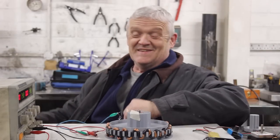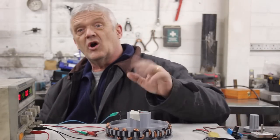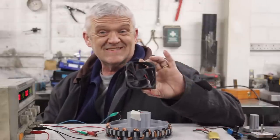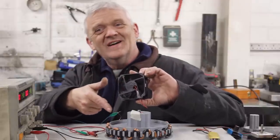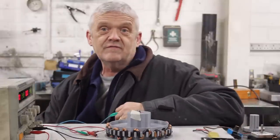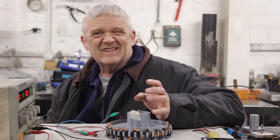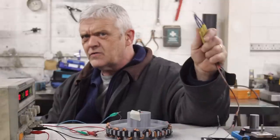With a single coil it's a bit difficult to get the timing right, but with two coils it's a piece of cake. That two-coil arrangement used to drive this as a motor is exactly what you find in a PC fan — a little circuit board in there drives the motor. Put three coils on and you have a standard three-phase brushless motor, the kind found in e-bikes. The control electronics for that are available to buy online.